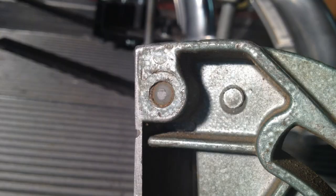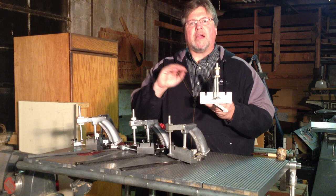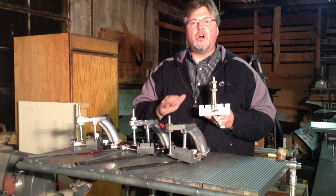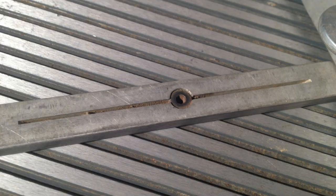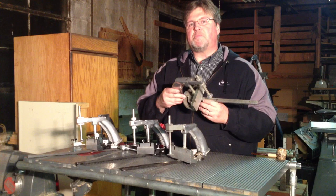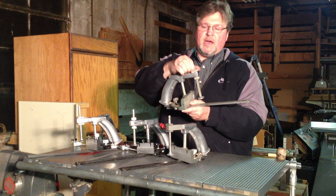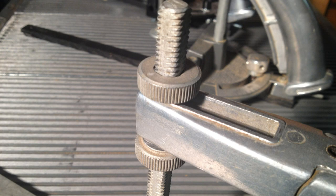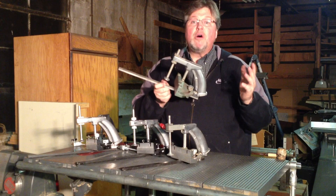On the bottom of this miter gauge, there are a couple nylon glides. You set this into the miter slot, and through the top you can adjust those glides down until the miter gauge protractor is just levitating over the surface of your table saw, giving you almost no friction as you're making your cuts. There's also a tapered set screw going into a threaded hole in the middle of the slot. That's used to eliminate side-to-side play or slop in the miter slot. With ShopSmith, there are times where the miter gauge becomes a bit of a fixture — I can tighten that down on the table and use it as an indexing point, especially on my drill press. The height adjustment for the clamp is made by turning knurled knobs on that threaded rod — not the most convenient adjustment, but it gets you there.